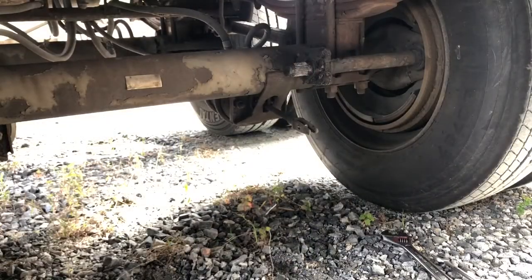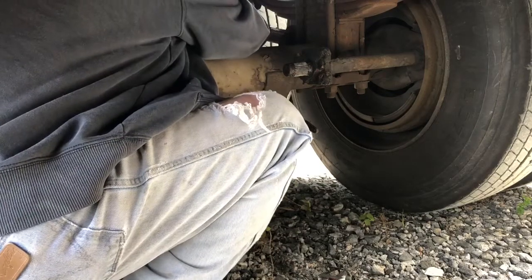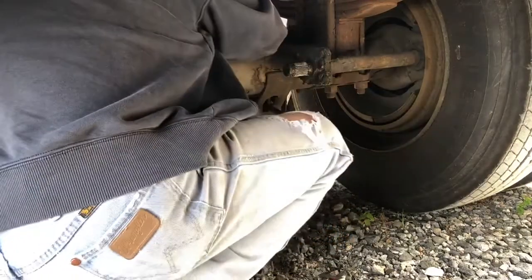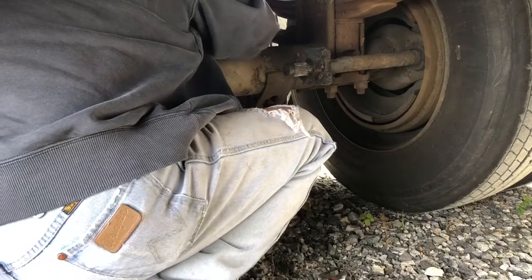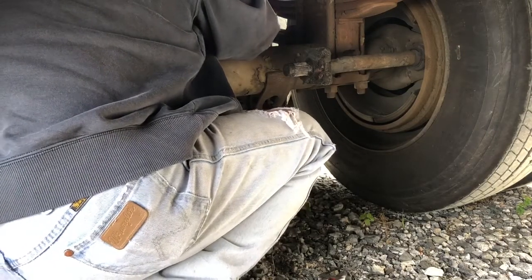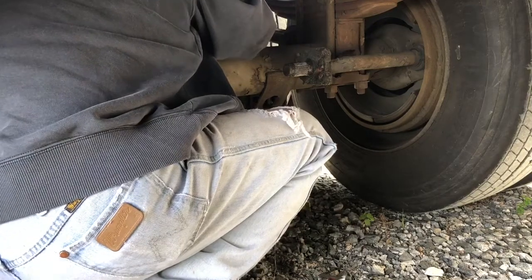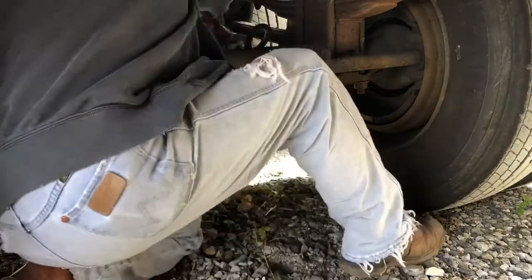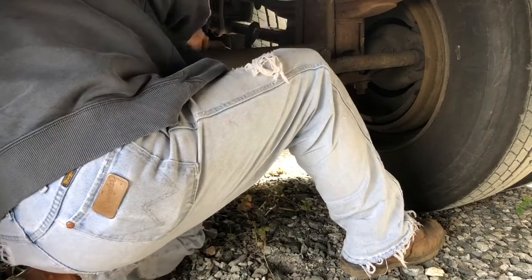All right. I'm going to get this chamber out of here. Center chamber. 15/16ths under here. First, get these lines off. You can discharge all the air by twisting this petcock right here. But I like to live dangerous, so I'm going to get my eyes blasted. These are 7/8, and they should swivel. Getting pretty lucky here today with this stuff not being stuck. There's that one. There's two of them. And stuck. There it goes.